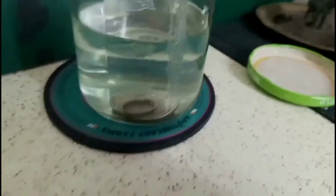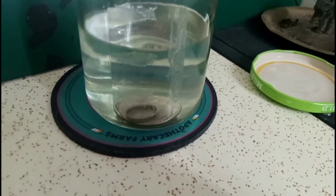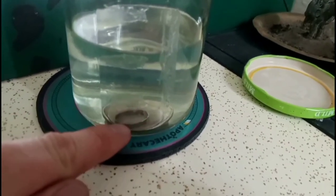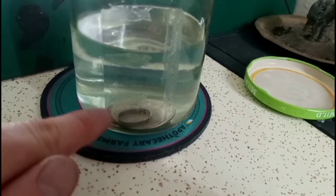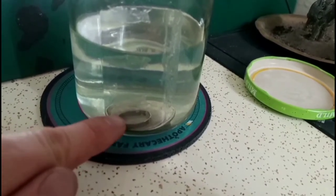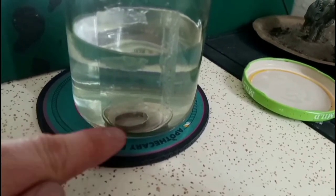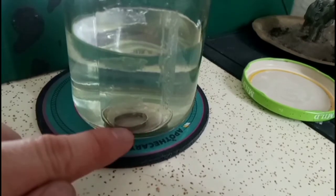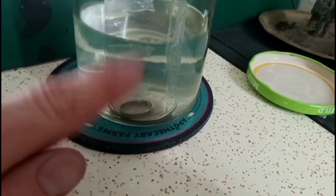All right, we're back for a second. I goofed up and didn't get any footage of doing the bezel, but I came back inside, dropped the coin we were working on down in the pickle here, and then I went and I got some bezel wire that I got from Rio Grande Jewelry Supply, and I measured it out on my stone, I cut it, I soldered it, and there we have the bezel that we're going to use.